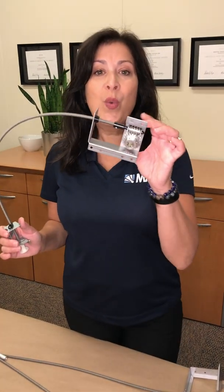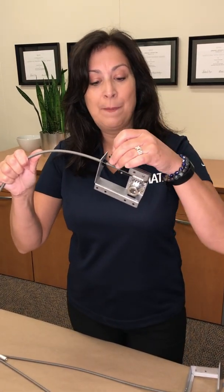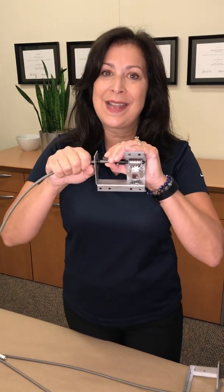With our Worm Gear Actuator, it works a little bit differently. You don't want to disturb anything on the termination point — all your changes will be made at the Worm Gear side. You simply loosen up your set screws, pull out and remove the cable termination, cut it to your desired length, take that same field cut cable end, insert it into your Worm Gear, slide that cut cable back into your Worm Gear Actuator, secure it with set screws, and you've shortened your cable in the field. If you need to lengthen it, loosen up the set screws, remove the cable termination, slide in your new cable extension, use your coupling, connect the two together, and you've lengthened the cable in the field.